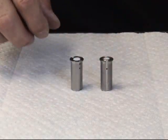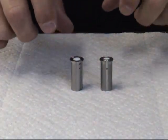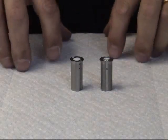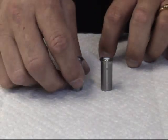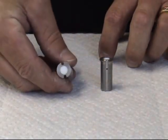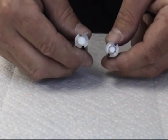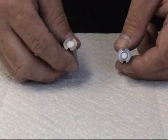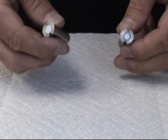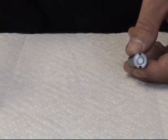Those are just important things to know — as well as the diameter of the stem and the overall length — just to make sure we get you the right parts. Most commonly you used to see pin plungers, but today you're more commonly seeing the self-compensating. You can't mix them — you can't put one in the other because the stem depths and lengths are different. So you want to make sure you have the right plunger for the right solenoid.